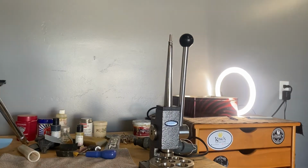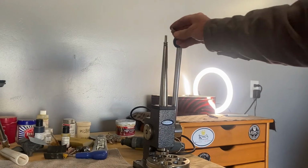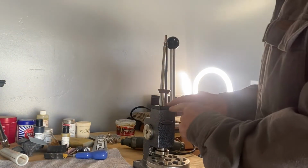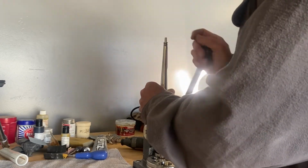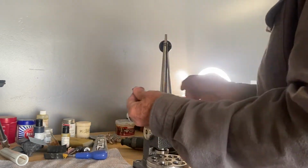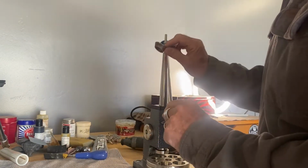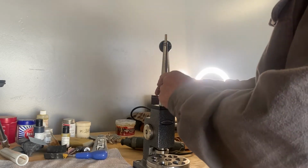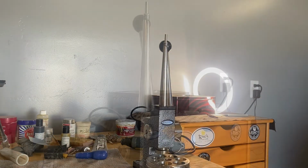And we're gonna put it on the stretcher, and we're gonna stretch it out till it reaches the very bottom of the stretcher and won't go any further. But the first thing we're gonna do is anneal it again. You gotta keep annealing it. No cracks, perfect looking ring so far. We don't wanna mess it up now. I'm gonna go anneal it, come back, stretch it out till it gets to the bottom of the stretcher, and I'll bring you back in and show you what we have.